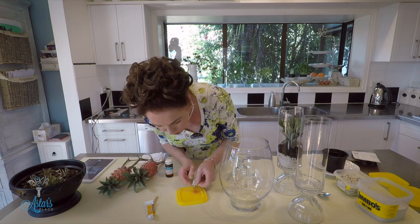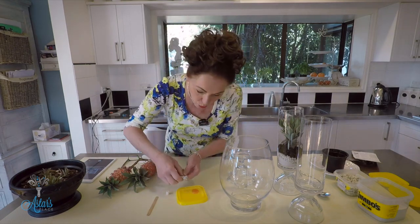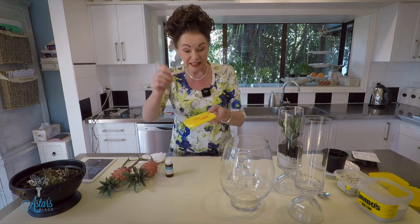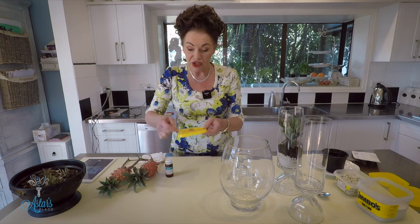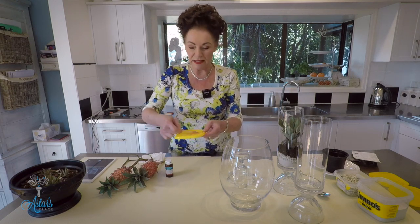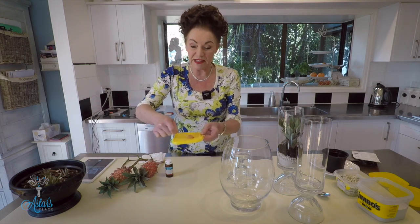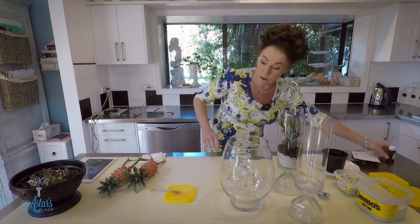It's equal parts of both the epoxy resin and the hardener — just squeeze all of that out. It is important that you have exactly equal parts. Then get a stick and spend a good bit of time absolutely totally blending the hardener and the resin together. It stinks, but I've got all my windows and doors open so it's fine. Keep stirring — the more you stir it the better it's going to be. It comes out a little bit like snot, but that's what we want.